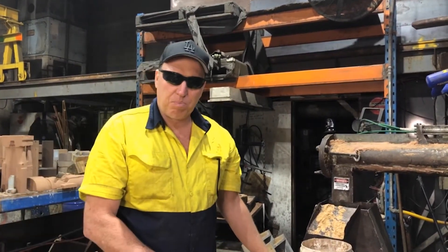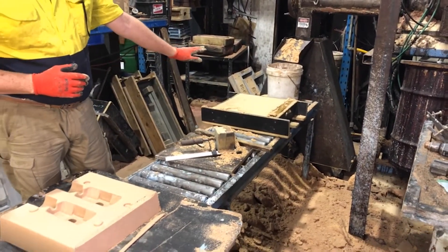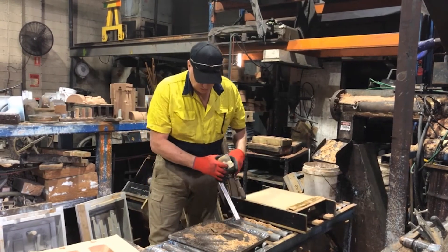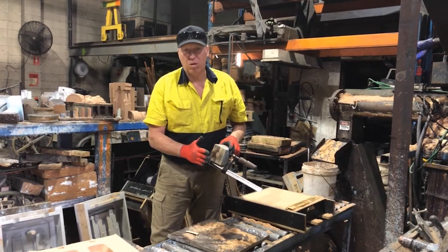That's basically the moulding process. Over here is one I've done earlier today — there's two halves. We're going to show you how to close them up once the sand has gone hard. It's well compacted. But first you want to knock out the core. Before you knock out the core, always turn it over and strickle the base to make sure it's flat. We don't want it bigger than it needs to be.